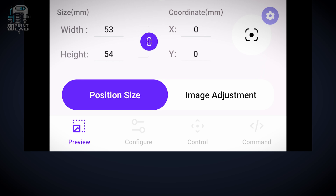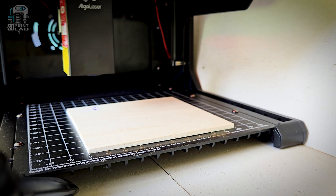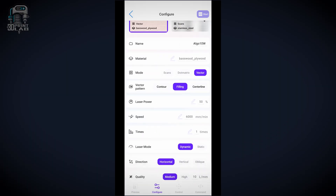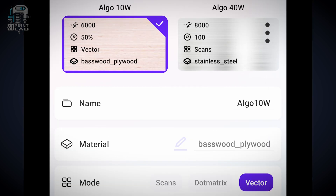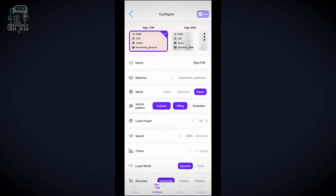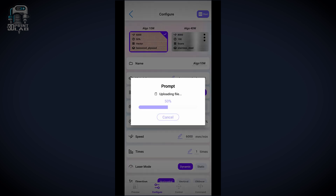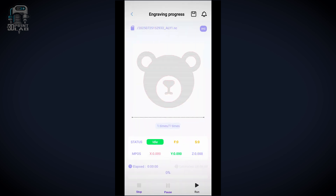Across the bottom you're going to see a row of icons that'll help you get everything dialed in. The first icon is a preview, which lets you check placement and scale. I was using a 99.5 millimeter square basswood board, so I resized the bear to about 90 millimeters to give it some room. You can use the laser preview tool to double-check alignment on your material. Next is Configure — this is where the magic happens. You pick your material; I selected basswood plywood and the app automatically adjusts power and speed based on the presets. It's fast and removes a lot of guesswork, especially if you're not into constantly fiddling with settings. For this first test, I left everything as is, except I turned on both filling and contour, hoping that would engrave the bear and then cut around it. The app estimated 17 minutes, so I hit start.